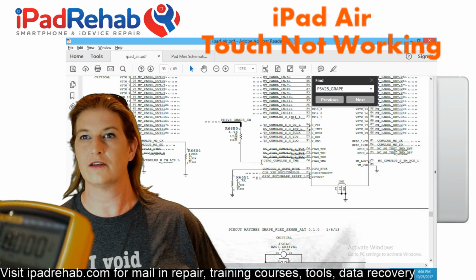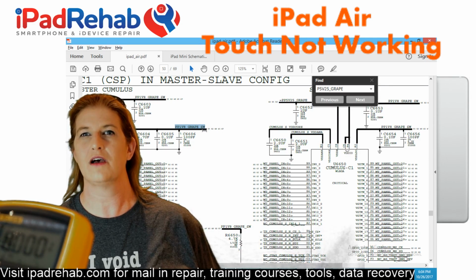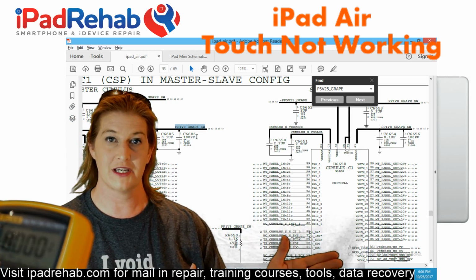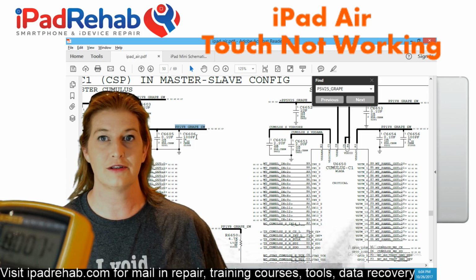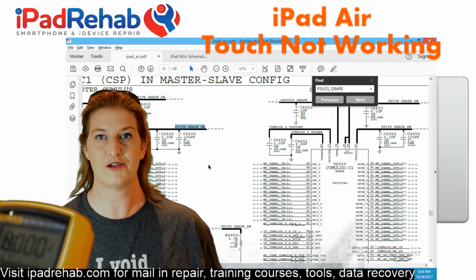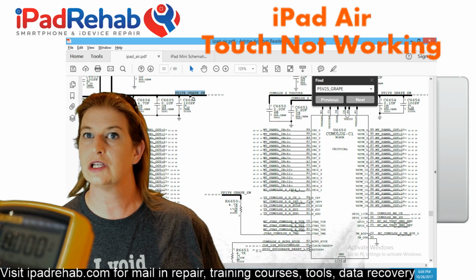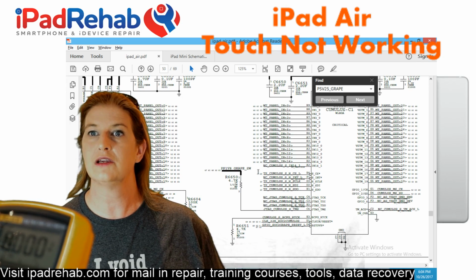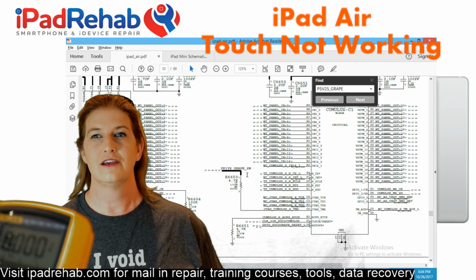And here it is again over there. That's not our line, is it? Yeah, it is. It is there. PP1V, oh yeah, this is the renamed section. We followed from the PMIC PP1V8 grape SW2, and it turned into PP1V8 grape SW. So there it is, meaning it should be present here at the cumulus. It should be present here as well, because we've kind of restored 1V8 to that line.